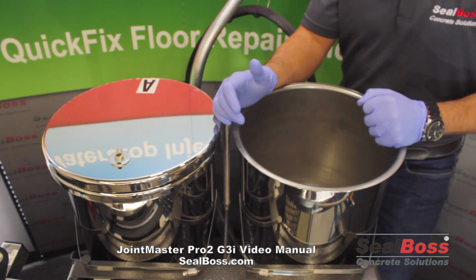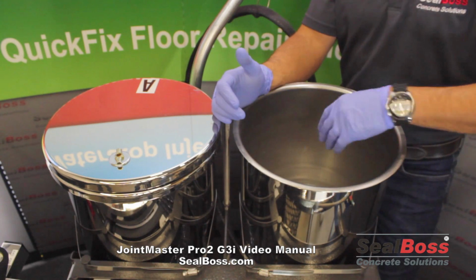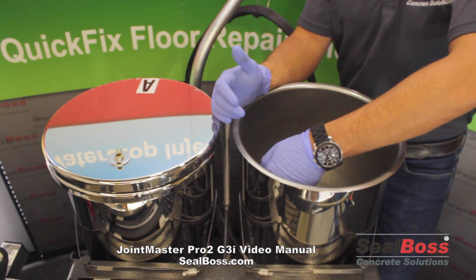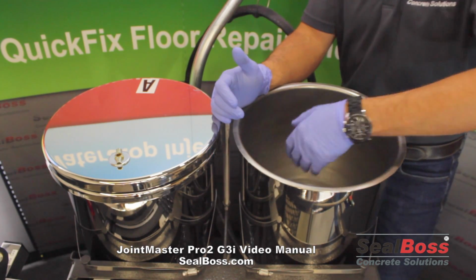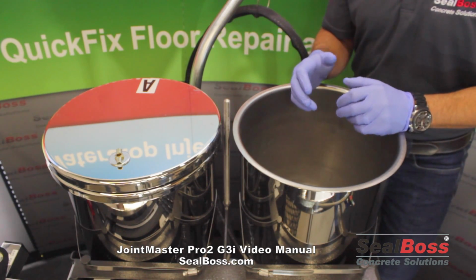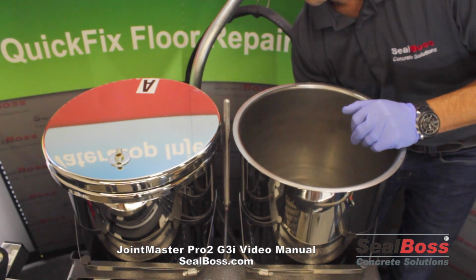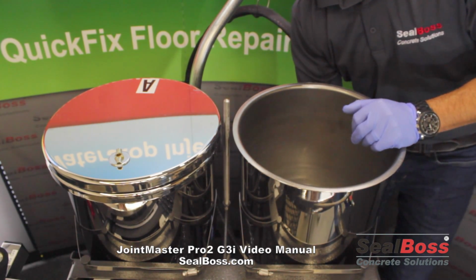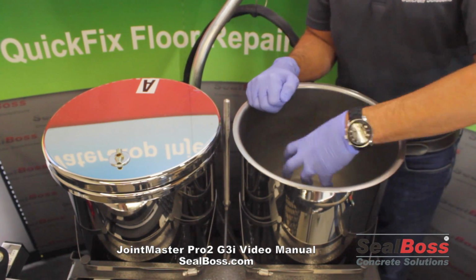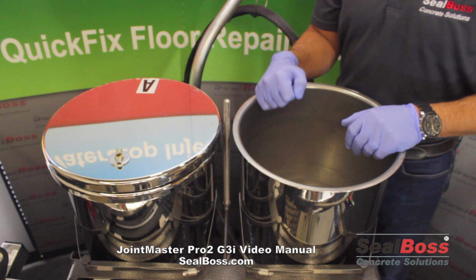What you're going to do is start high up on the inside of the tank when you're done with any given shift, and the idea is to utilize the xylene to rinse from the top down any material that's stuck on the inner wall of the tank itself, all right? When we do that on the A and the B side, we're obviously going to collect our xylene and residual material mixture. And again, just to be safe, we want to make sure our bleed-off valves at the bottom of the tanks are closed so we don't wind up spilling all over the place on the floor. So when we do that, we're going to collect that xylene on the A and the B side, and then we're going to run the machine as we would normally for a joint fill operation.